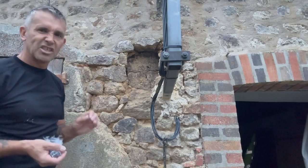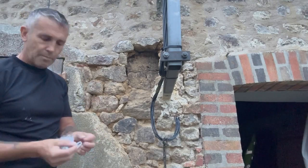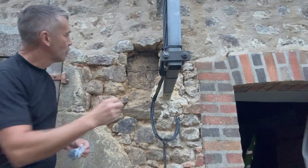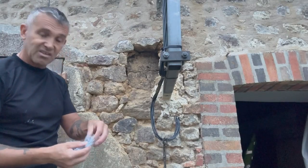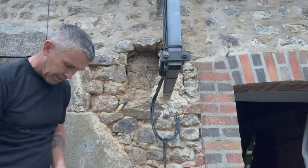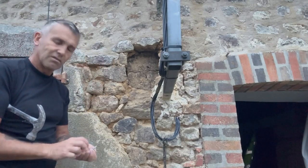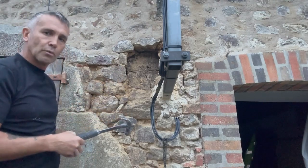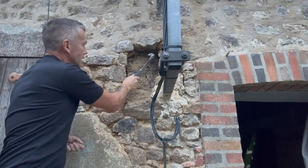I got these from a big multi-chain store — 10 euros for them, about nine pounds for two little bags. Anyway, they'll do the job. These are basically like little U-nails, and I'm just going to put them into the timber but not all the way in — I need them to be proud so the mortar will wrap around them. I've also got some of these curtain hooks, and I'll screw those in as well. That will help the mortar adhere to the timber and make it more rigid, because with expansion and contraction over the years from heat and cold it'll just crack and water will get in the back.